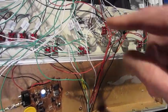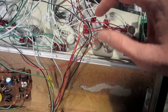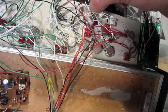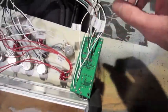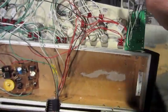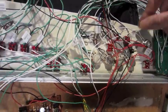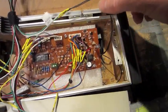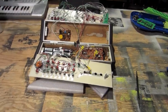And then on the delay kit, I've found quite a few different bends. I have a feedback 1, feedback 2, feedback 3, a fuzz bend, and a warp bend. And then all of those come back into the delay kit that I built. And then out of that last toggle it goes to the volume pot, then from the volume pot back down to the audio out, the 1/4 inch out in the back. And that's pretty much it on the inside.